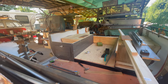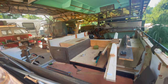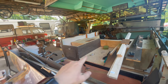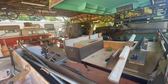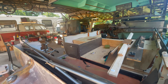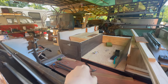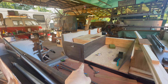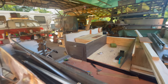It looks good. We went with the finished washer and the screws rather than the nails. We typically do that on anything we can — we try to go with a screw that we can take back out if we need to. This was all nailed together from the factory and it was just a bear to get out of there. So if you ever have to take that apart, it just makes it so much harder. Anytime we redo a camper — we've done a few — we try to make it where it's easy to get back into if you need to.